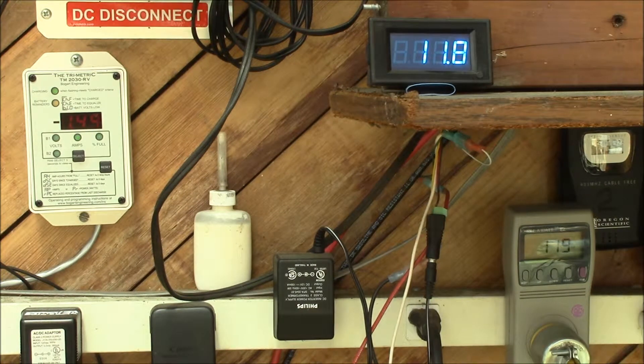I'm going to turn on this heat gun — it's around about 1050 watts — so that should put us up to around 1200 watts more or less, and we should be able to run that for up to a minute. I've got some heat shrink tubing and we'll see how this goes. It'll probably beep and make a lot of noise, hopefully just the intermittent beep, which means we're under 130 percent overload.